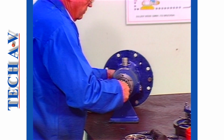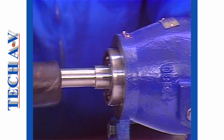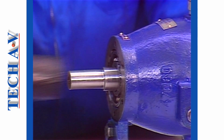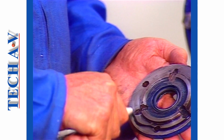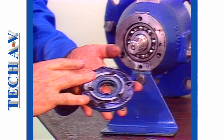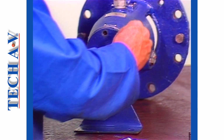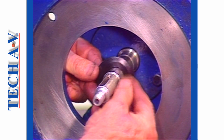The shaft, complete with its bearings, can now be installed carefully into the pre-oiled bearing bracket. End covers should be lightly coated with a silicone-based sealer to ensure a tight, leak-free joint facing. Refit and secure both covers. Don't forget to fit the flinger at this point.